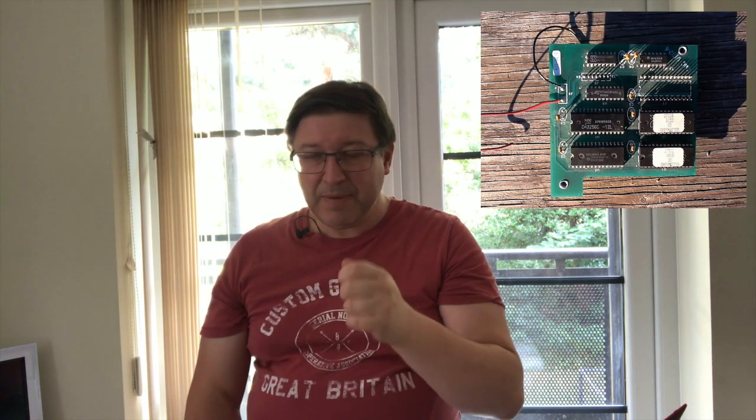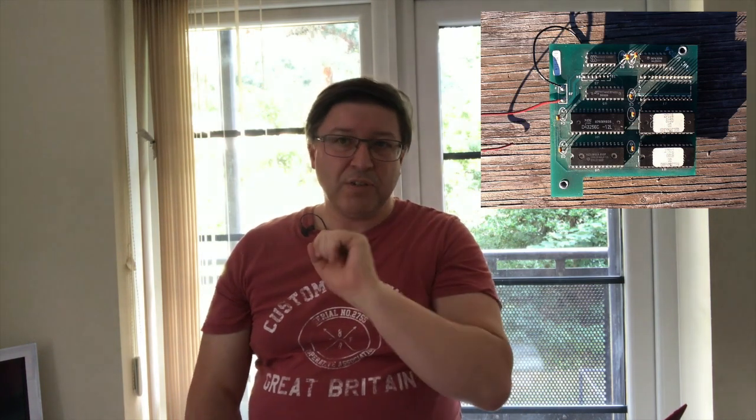It was an expensive mistake, because when I tried to bend the pin back it snapped and I had to go buy a new chip. Luckily that chip was still stocked by a major manufacturer. Those would be the first things I'd look at. The other thing about solder is, depending on who did it, where they did it, and the age of the solder used, it's very possible it never made a particularly good joint in the first place. If you have solder that looks very iffy, use some braid or a solder sucker to take the solder off and re-solder the joint with modern solder. Modern solder is a better conductor than solder used to be, and it doesn't have lead in it the way old solder did.